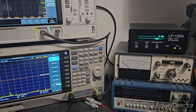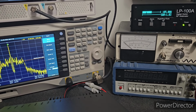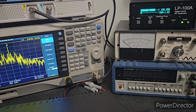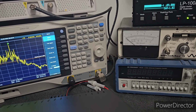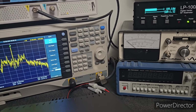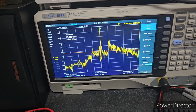Now this is AM, which I don't know if you're going to use that a whole lot over there, but just to show, it's about 24 watts or so, and it swings about 100. So there's really not a big difference from what I showed before on the first initial test video of the radio. We haven't really changed a whole lot. You notice that I'm not showing, oh man, look, we got 150 out of it now, because the real world doesn't work like that. You don't magically get all these big numbers out just by changing a magic part out and putting some new magic part in and saying, wow, look what I did, and charging $100 or $300 or whatever somebody wants to charge to do that kind of stuff. At least I don't do that, because it's not necessary.